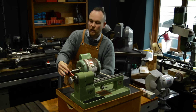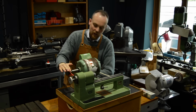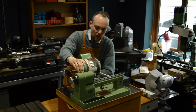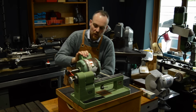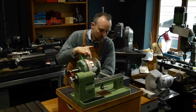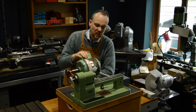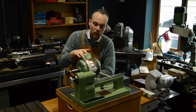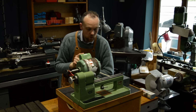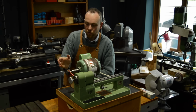I have got the ability to change the speed a small amount on the pulley here, but it doesn't make a massive difference. There's only a single pulley on the headstock itself. So this motor has started to trip out the electrics, so there's obviously a breakdown of insulation on the windings, I would guess. That is basically writing this motor off, because to me it's not worth investing in having this motor repaired. So what I'm going to do is take this motor off and take the pulley off, because I'll need to reuse that,